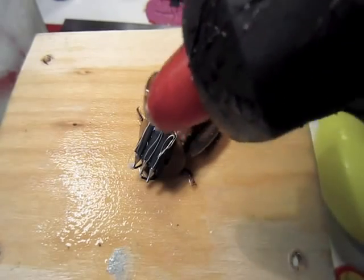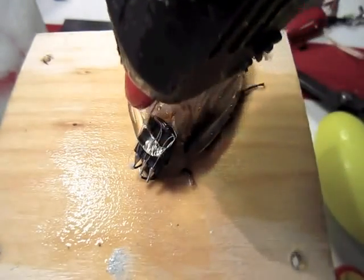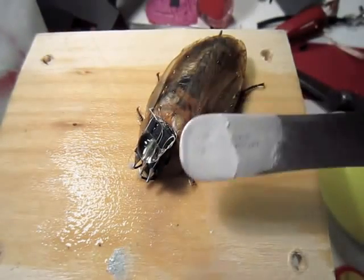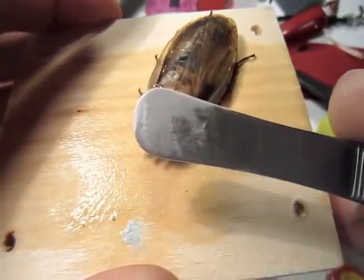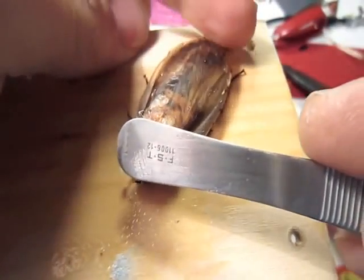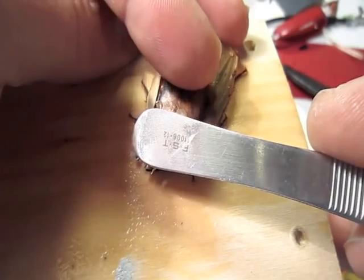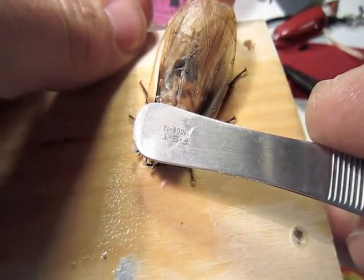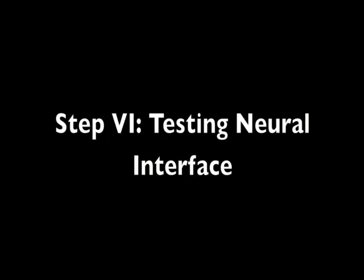Notice I have made my best effort to have all the excess wire tightly compact and organized on top of the connector. Now to hold the excess wire in place, place a dab of hot glue on top of the connector. To make the hot glue spread evenly on the connector and hold all the wires in place, I have coated the end of my forceps with baking soda and pressed the forceps gently onto the hot glue. The baking soda prevents the hot glue from sticking to the forceps. After a couple seconds, I gently lift up the forceps and it comes off quite easily.